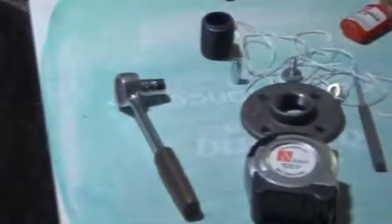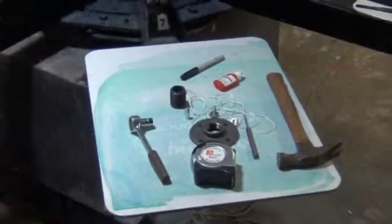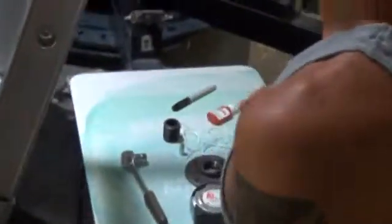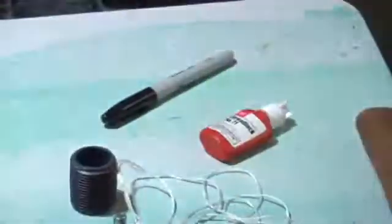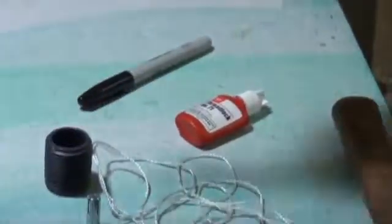Now I guess we will need the ladder again. I was wrong. You want to go back up and install the flange. There's 4 bolts that are required for these anchors, and we're using washers with them. Now if you want to, I've got some Loctite sitting on the pallet here. You could put a few drops of that on your bolts if you want to, just to make sure they can't come back out. Now these bolts require a 7/16 socket wrench, and that's what Tony's going to use.